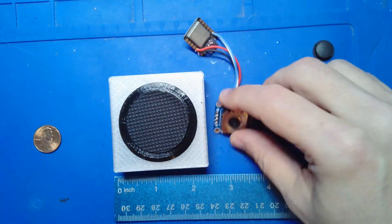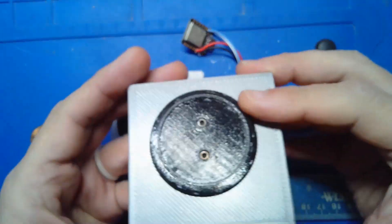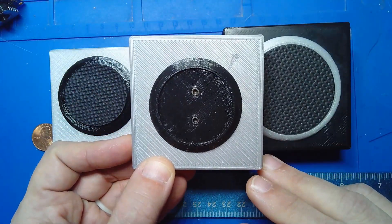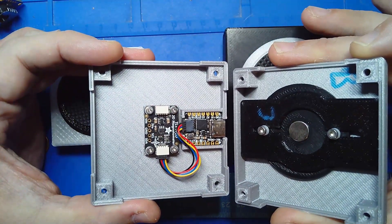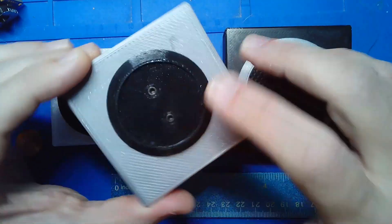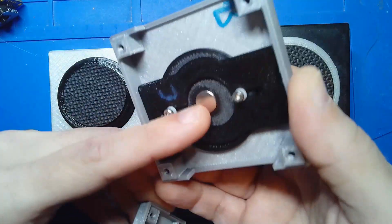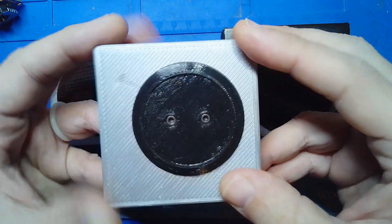That is what's happening with sliders. I'm also looking at other options for sliders, which are very exciting and these are in the earlier days. This is a version of my slider that is going to be a hybrid between my original and the Plus size version — you can see it's in between the two in size. The really big difference here is the componentry we use to record the movements. This is a magnetic sensor inside, so there is no physical joystick component to wear out in here. The parts are all 3D printed, and there's a magnet that is picked up by the sensor, which is then understood by the microcontroller.